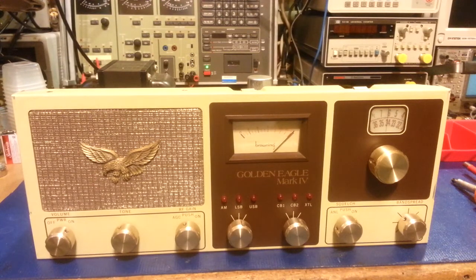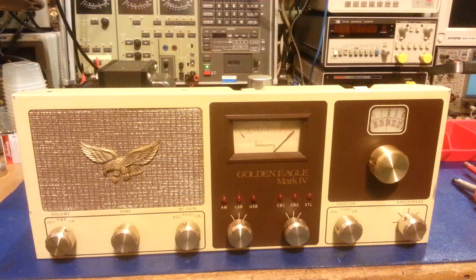This video is a follow-up to the previous one where this radio was brought in for repair and alignment. The repair was simply microphone plug wiring, and that's been taken care of. The radio transmits now but had hardly any modulation — that was not the radio's fault either; the microphone cartridge on the mic was also bad. The radio seems to be working just fine.